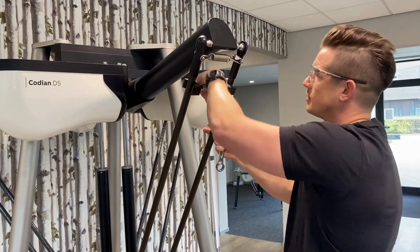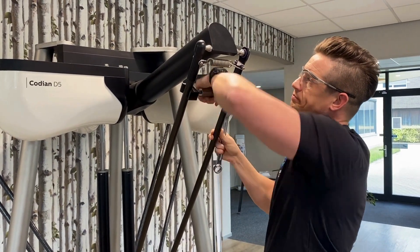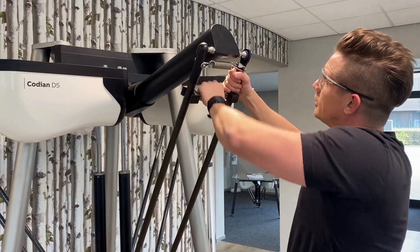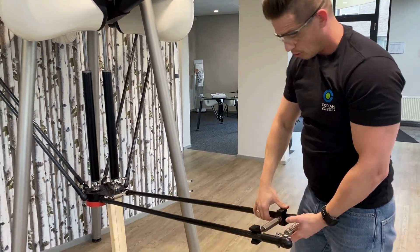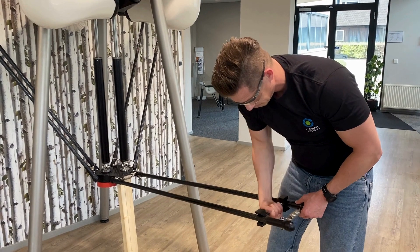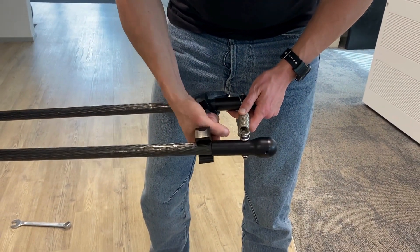In this case I do it by hand because it is faster, but if it takes too much force you can use the wrench to make it open. As you can see it detaches quite easily because of the tension of the spreader, and once it is loose you take out the arms like this. I always put them down, hold them and release the spreader. This is important because you need the space to further detach the arms and springs, you take it out.